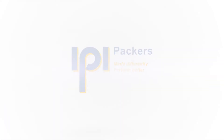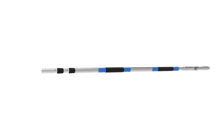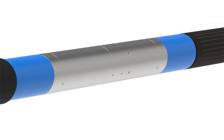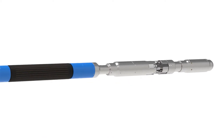Inflat-A-Lock from Inflatable Packers International is an insert type progressive cavity pump anchor system. It incorporates inflatable packer element sealing technology with hydraulically actuated anchoring slips, providing a means of deploying, positioning, and setting an insert PCP in downhole completions without the need for relying on a pump seating nipple.